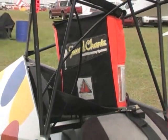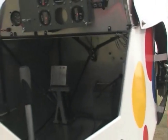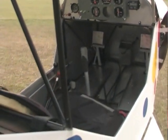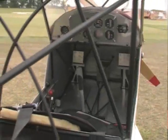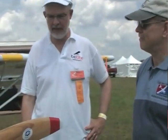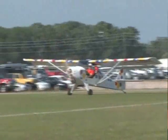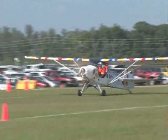We've got a number of engine choices, but the point I want to make is that you don't have to throw horsepower at airplanes to solve problems. By staying light, we were able to use a 28-horsepower single-cylinder Hirth. With a good airplane, 28 horsepower gives you fantastic performance. We're using a stock F-33 from Hirth, and the takeoff acceleration is breathtaking — how quickly it breaks ground and how steeply it can climb, all a function of the aircraft's weight and smoothness.